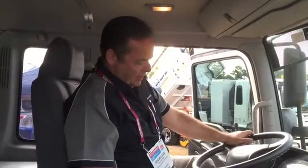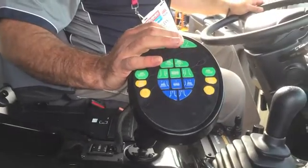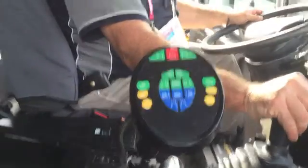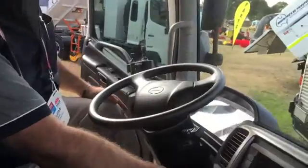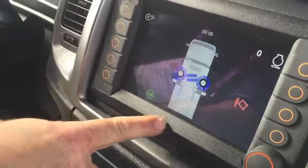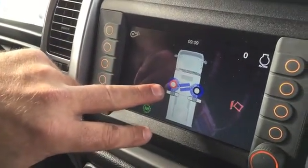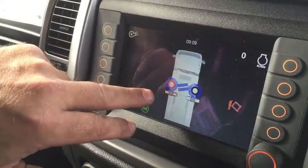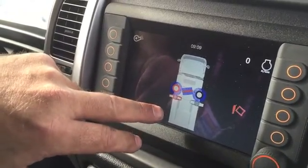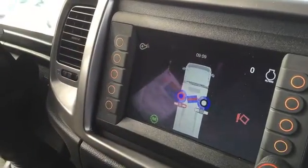To work this truck, as I said, clutch in, hydrostatic, which is that button there, it'll engage it, and then once it's in hydrostatic mode, truck goes over into the 6th gear, and then you foot off the clutch, and that's it. It'll just sit there. That'll go from the manual symbol over to the H for a hydrostatic symbol. Now you can see that function there. That's basically your sweeper display screen. I hope it will show up in colour. At the moment that's in the entirely off position. If I push that, that's red for standby. Then I add water to it. Blue represents water. Then I can go across to my control pad.